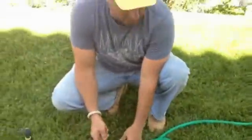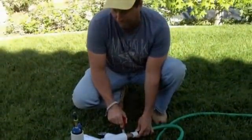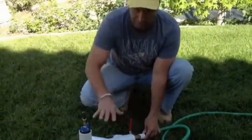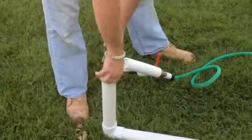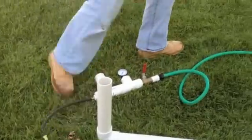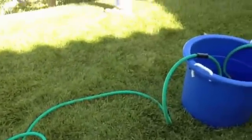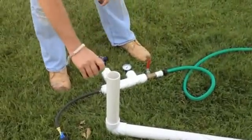So now that I have my system running, without having to unplug anything, I shut my pressure valve off. And what I can do now is, since there's no pressure in there, I can take my injection plug out. I'm going to pour my Part A — the filler — right into the line.